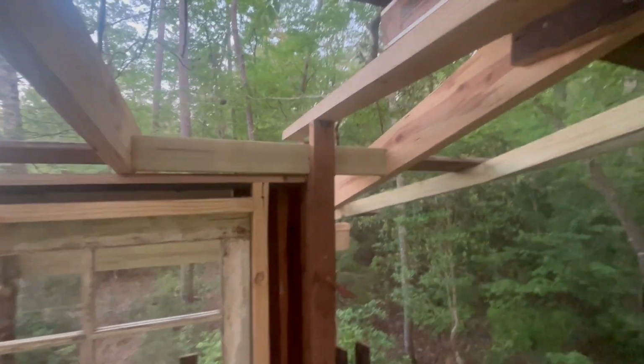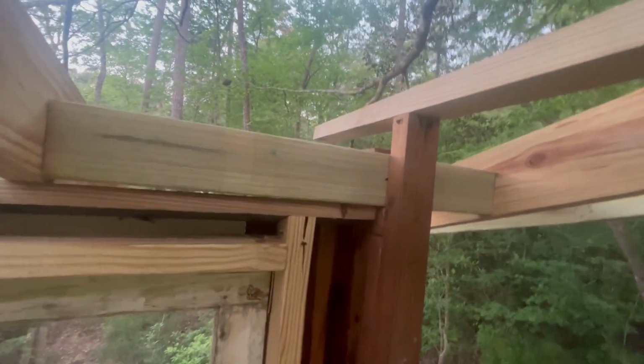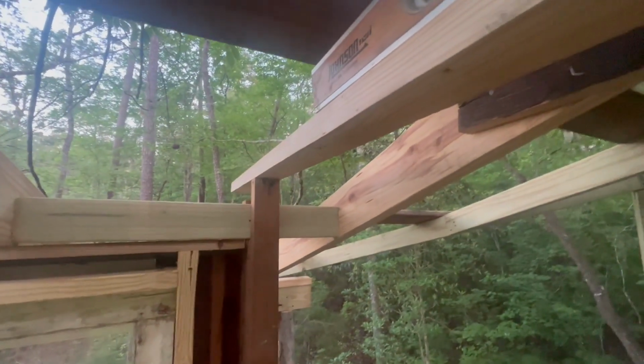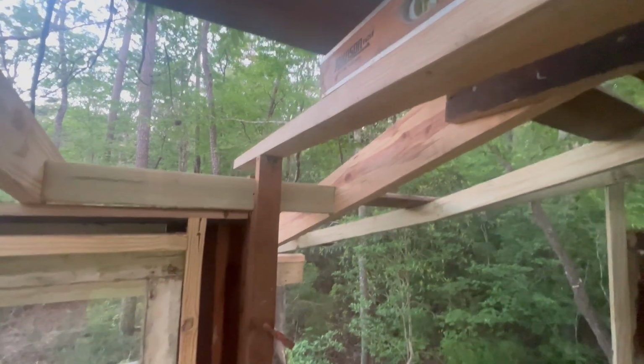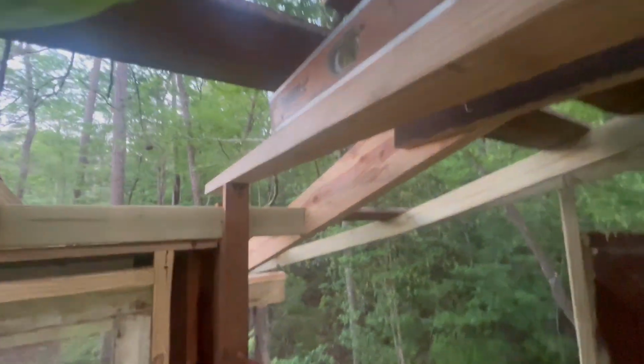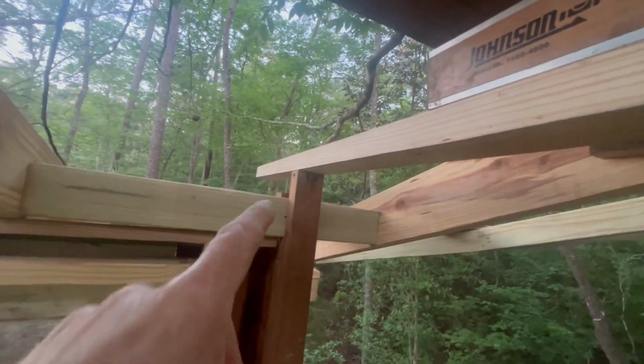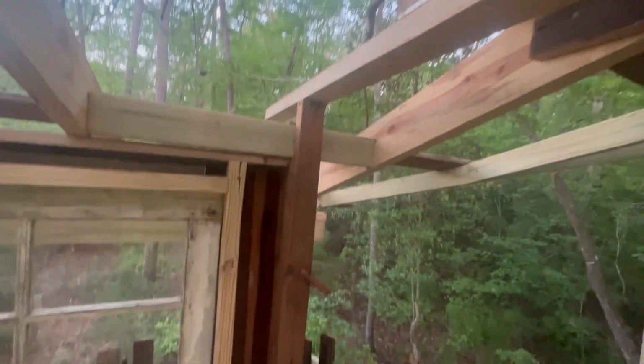Oh no, I can't. That's poking out the roof, so that's not gonna work. Anyway, this is where it needs to go. I'm gonna have to fasten some sort of brace to have it right here. Darn it. I'll probably put a 2x across here to screw this to, and then wherever it's gonna start protruding from the roof, cut it off. But this is where it goes.